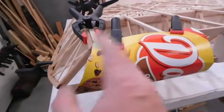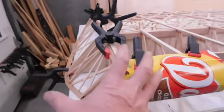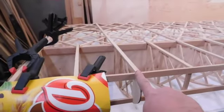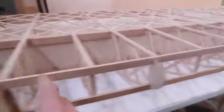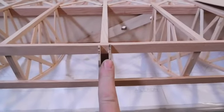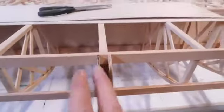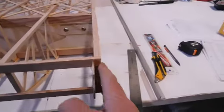So I was thinking about that, and I said, well, we won't start here, we'll back it up 6 inches. But then I thought, I don't want to end on a false spar, so let's back it up 1 foot. So I came down 4 feet, put in the double spacers there. So one piece of plywood will come to here, the next will start there. Meets up here, double spacing comes on down. So this way I've got waste on one end and waste on the other end.